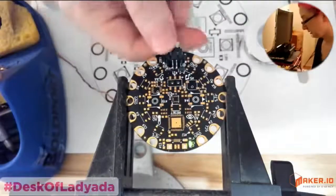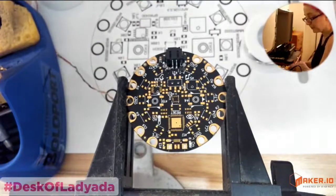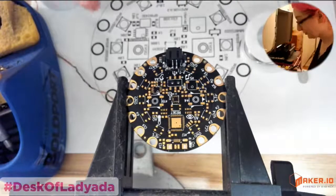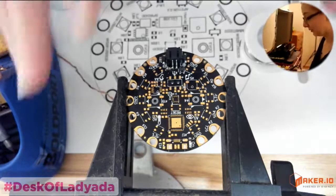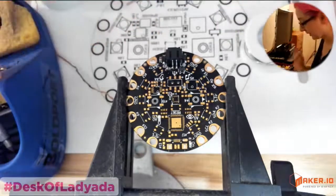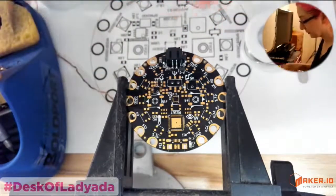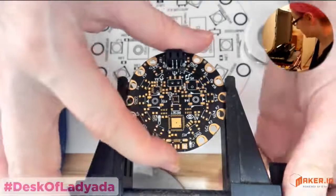Nice. So as you place each part, if they can light up, you light them up, and you also test a voltage. This is the voltage regulator. Do it first, because if you get that wrong, you can destroy everything else. So do the voltage regulator and make sure your power supply is really clean. Normally, I'd take out my oscilloscope and see the voltage, making sure there are no spikes or anything, but just to keep it easy, I'm only using the multimeter.